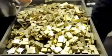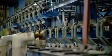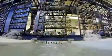From the other end, they move on to be nickel coated. Because chrome doesn't adhere to brass, the nickel will function as the glue for the chrome. The cases are dipped into a nickel bath. As the machine lifts, you'll see that the parts are no longer brass, they're covered with nickel. After the nickel plate, the shells are rinsed. Five rinses follow the nickel plate, then they go into the chrome tank. After 4 minutes in the chrome tank, the case gets that signature Zippo look.